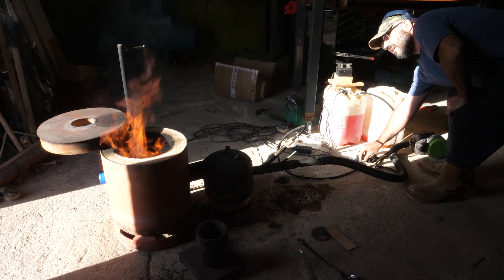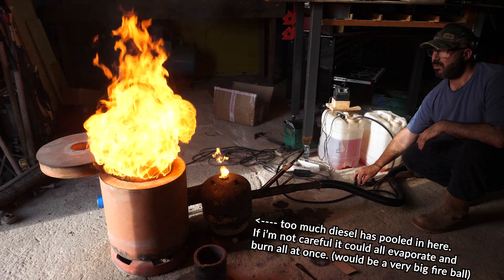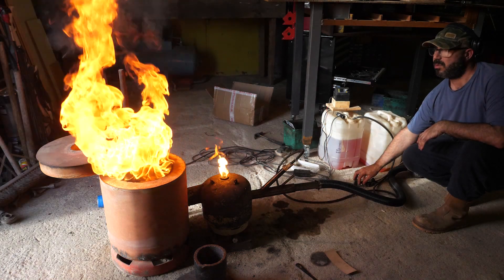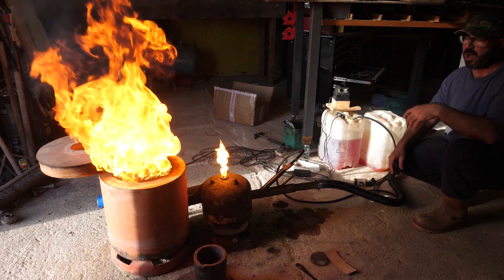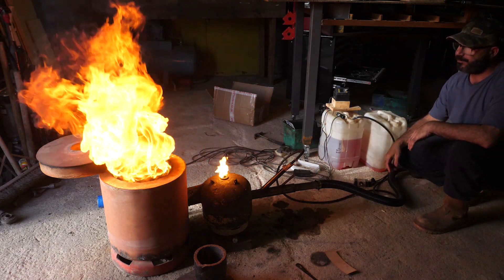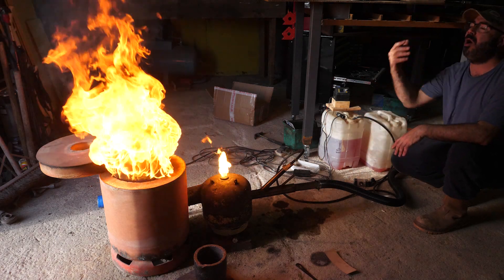I had a lot of trouble getting the furnace lit this time. It had taken so long to light that the diesel had pooled in the chamber, so I had to be careful not to turn up the air too much until the diesel had been used up. It was very dramatic and not in a good way. It's still too much diesel. I turned it off — it needs to burn away. There's probably a little bit too much diesel in that tank. It's the one drawback with this. We've got to wait for that to burn off, then I'll restart the diesel. I don't know if it was a whoosh off at the same time — it'd be a big old fireball.